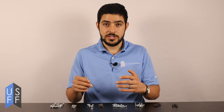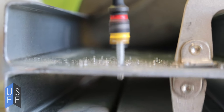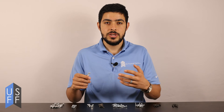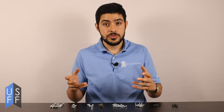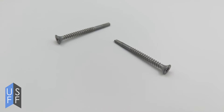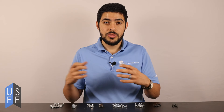It's actually very much about the pressure you apply and making sure that your surfaces are clamped together well. A clamped surface will drill much more easily than a loose surface that has the potential to jump around while you're screwing it. We also sell a very specialized wood screw that connects plywood to metal studs — it has a section that's unthreaded, which allows you to screw through the wood without pulling up the wood while screwing through the metal stud.